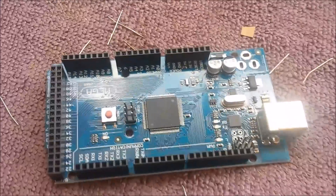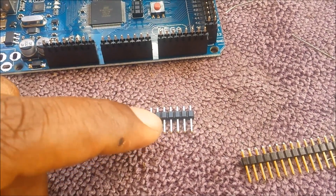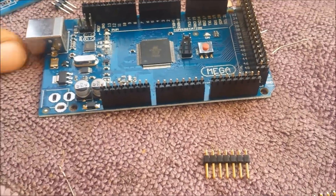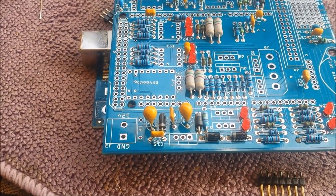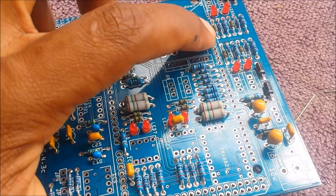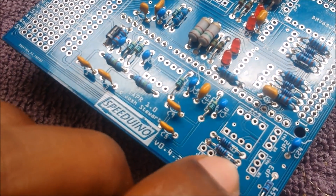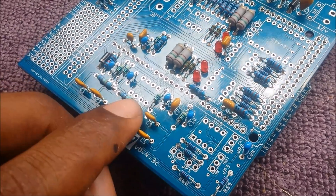This is the Arduino with the pin headers — it has a long end and a short end. The long end goes into the Arduino and the short end goes through the PCB, and you'll be soldering to the top of that. The board also has some other jumpers — two here, two here, three there — five in total. We're also going to solder all of those.